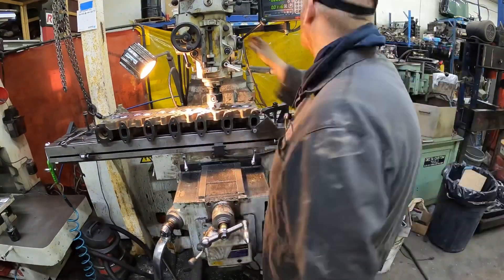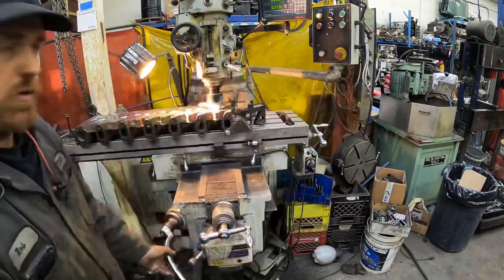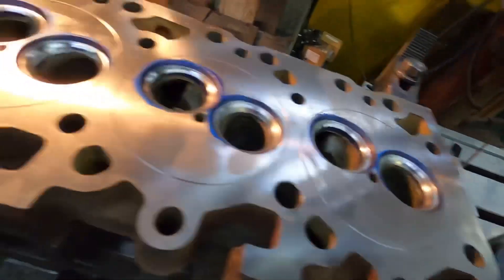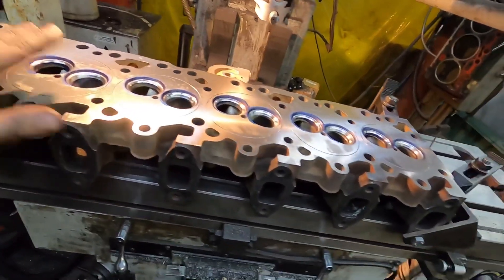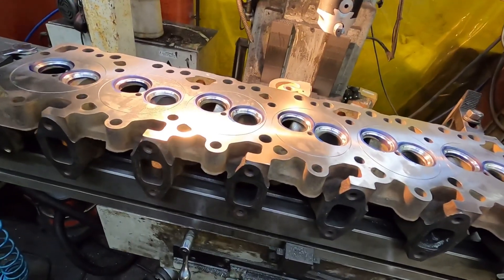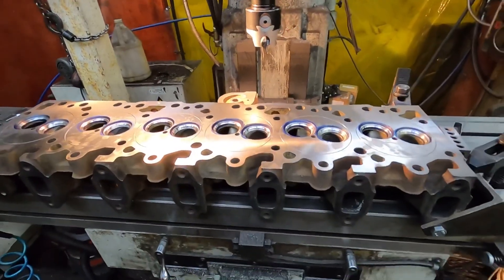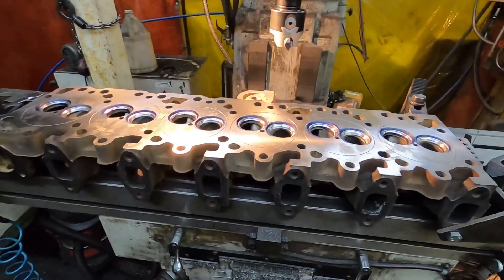Not really too much other than that — you just have to make sure that you get every one relatively consistent. Got the receiver grooves all cut, put the o-rings in, went no problem. In the time-lapse it's hard to see but basically I center the o-ring grooves off the gasket. You want them to fall pretty close to the middle — I like to go just a little bit on the smaller side versus dead center — then you just line it up.